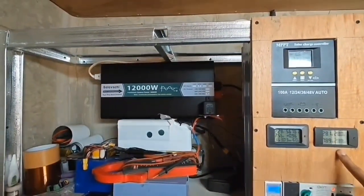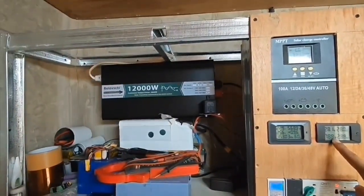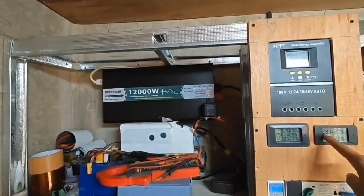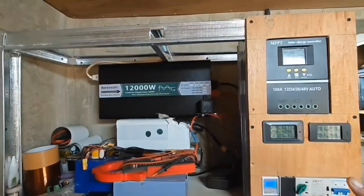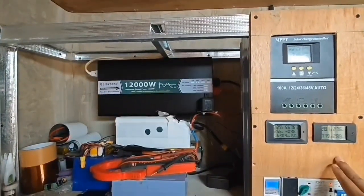As of now I have an extra of almost 200 watts, because total is 789 watts. The battery is nearly fully charged at 28.1 volts — when fully charged it is 29.2 volts, but I set it only up to 29 volts to prolong the lifespan of the battery.